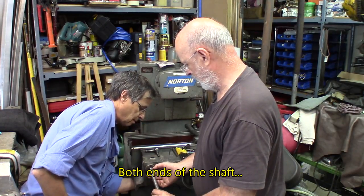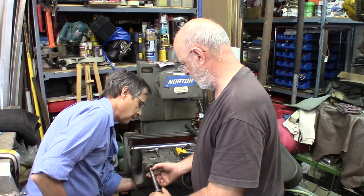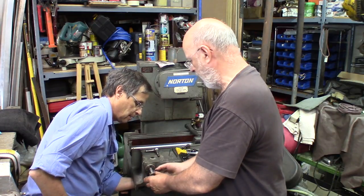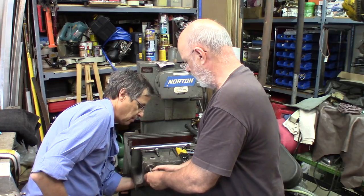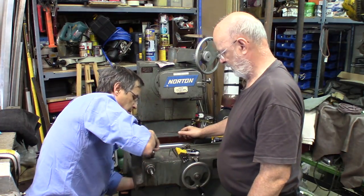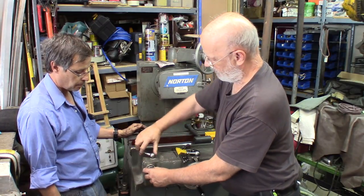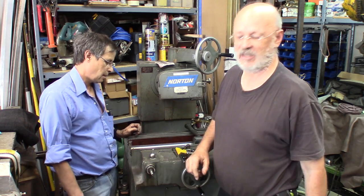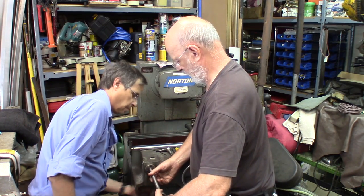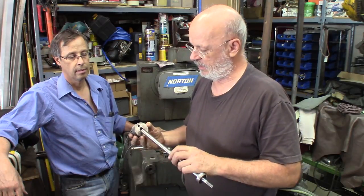There are needle bearings in there — slow and wiggle while you're making it through. In the middle of the shaft there's no bearing or anything like that. There we go — this is going in very smoothly. Brake portion is done. Now we're turning it — about half a turn — and it's solid. It doesn't move. That's going to be very solid and very sturdy.